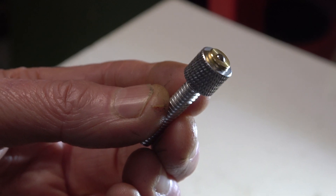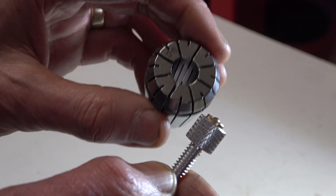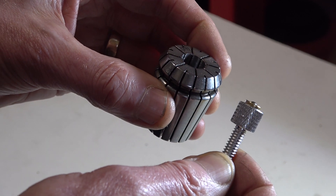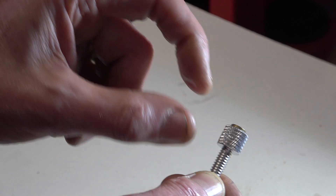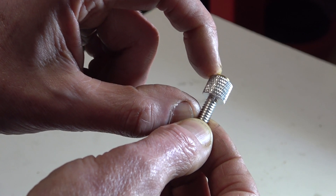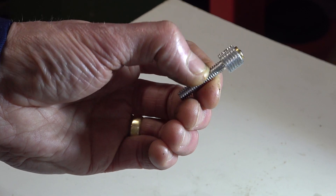I didn't want to put it in too deeply because it's only aluminium and very soft, and I didn't want to wind the head off. I put this larger diameter into a 12 millimetre ER32, and as I explained, they don't grip very well on short pieces — it was very difficult to get it to grip. So I went against my own advice, because I'd already drilled this through with the 2 millimetre and was worried I'd wind the head off. So as I do the others, I'll drill the 2 millimetre hole at the very end. All I need to do now is cut this about where my thumb is, and we can try it in.